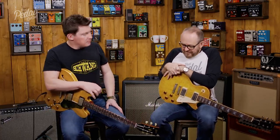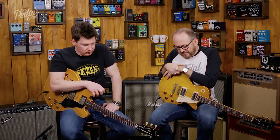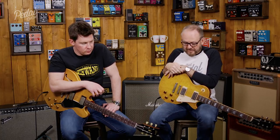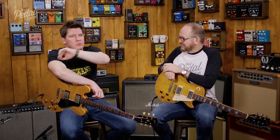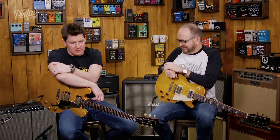And see, the fuzz face, it's such an amazing circuit, and I'm loving it more and more. And the whole input impedance mismatch, that's a reason the fuzz face is one of the first pedals to have a true bypass switch on it. Because when it's on, it's really low input impedance, high output impedance. Imagine that with the circuit bypassed. There'd be nothing left of your guitar sound. I have to say the whole low high impedance thing just totally goes over my head, and I need to go onto Wikipedia or something and do some reading. Okay. Not now. I'll find a way to make it really simple. I know it shouldn't be that hard, but you know me.